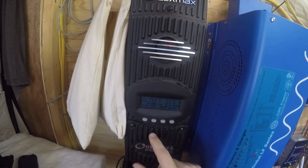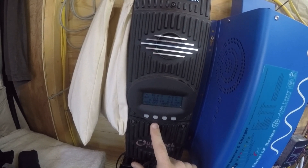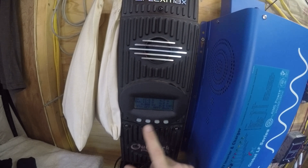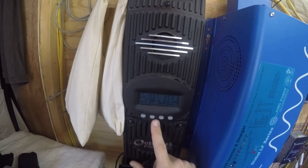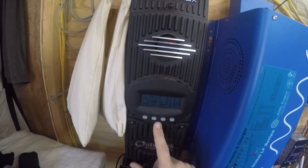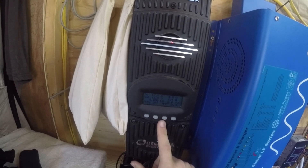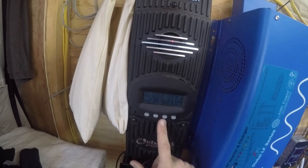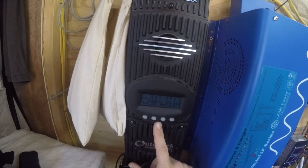Now this isn't the best configuration of solar panels for this charge controller, because this charge controller can take a high DC voltage coming in and change it to exactly where it needs to be to do the best job charging. With this configuration I'm only putting in an open panel voltage of about 20 volts on these 12 volt panels, so it doesn't give a lot of voltage range to work with. But right now it's settled down to about 17-18 volts in, about 5 amps in, and 13.3 volts out at 6.3 amps. Doing pretty good.